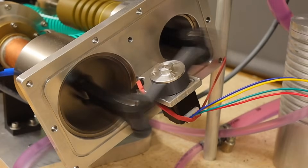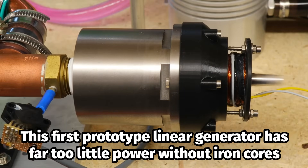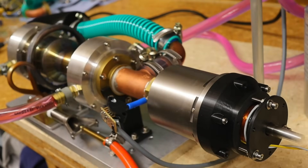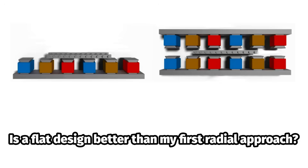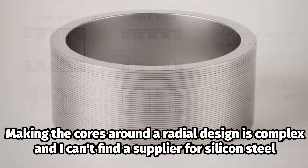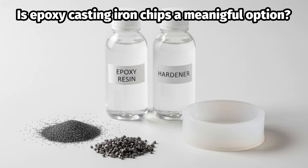I have also noticed that the efficiency of the oscillating stepper motor is very poor. The crankshaft oscillates at a very small angle of approximately 30 degrees, generating hardly any power. This brings me back to the linear generator, which is eventually going to be used anyway. To keep friction losses to a minimum, a lightweight piston with relatively small magnets without balancing would be ideal. Would a flat design have advantages over a radial linear generator in this case? I still haven't managed to find a source for electrical sheet metal or silicon steel and am on the lookout for large transformers to dismantle and use the iron core. The construction of iron cores from sheet metal for an effective linear generator is very complex. Is it an option to cast iron chips with epoxy resin into molds, or would this result in very poor efficiency?